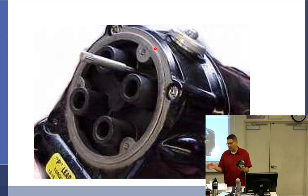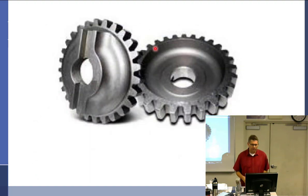Don't leave it in there, because when you do this procedure, you're going to end up moving the prop a little bit, and if you leave it in there, you are going to do some damage. If it's here at school, you're just going to bend the pin over and have to take it all apart and fix it. If it's out in the field, you really should replace all the components in the magneto, which is going to cost you a lot of money. The engine ran great after that. Yeah. This slide reminds me to tell you of two things.